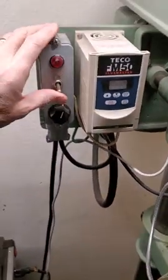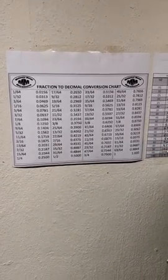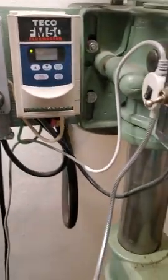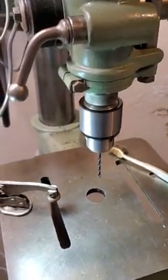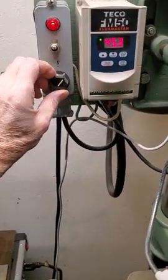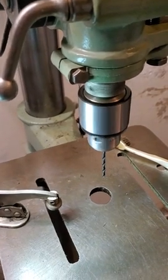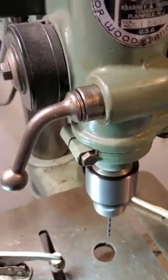I also added a little light so I can see what I'm doing. I'll turn the VFD on — I've got a frequency showing here — and I have a little cheat sheet chart on the wall that tells me the spindle speed based on the frequency shown on the VFD. So it's pretty simple. I've got the VFD on, I'll go ahead and turn on the drill press, and it runs. I can vary the speed just by turning this knob here. It's very, very versatile.